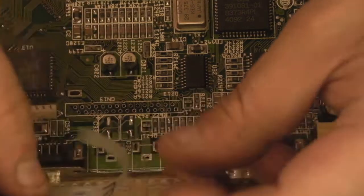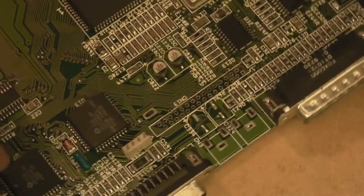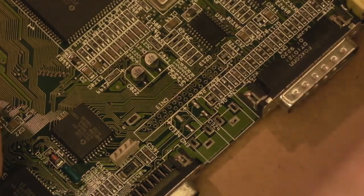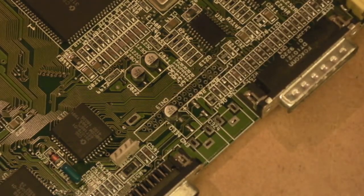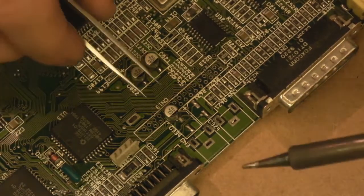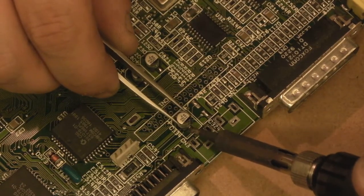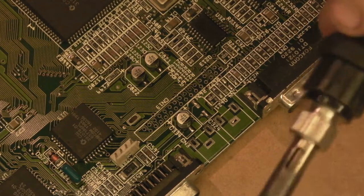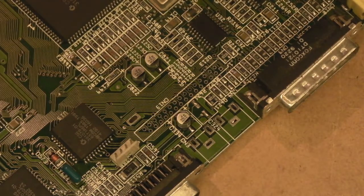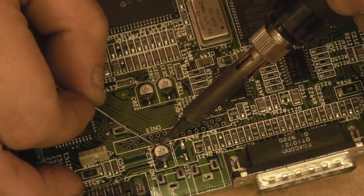He then gets his capacitors. Get the capacitors out of there. And what he does, I might have to turn the board slightly so I can get in. I've got a positive that way. And basically what he does, get my tweezers ready. He gets his capacitor, and he heats the pad, and just basically drops the capacitor in place. That actually worked really well. That worked incredibly well, actually. And then he goes obviously and solders this pad normally, a bit like I do from this point on.